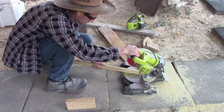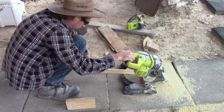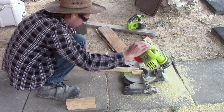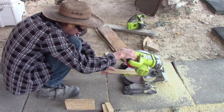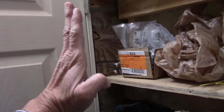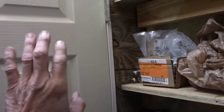I don't know why anybody paid for shims when you can just rip a few real quick. You see how this has a spring to it? What's happening is the side that has the hinges is tilted slightly that way. I need to shim this out just a little bit and that will square it up so this doesn't have that tension on it.